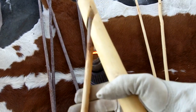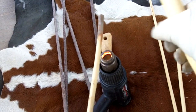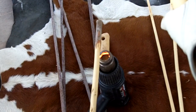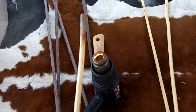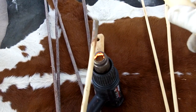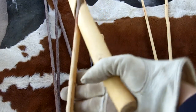I listen to make sure I don't hear any cracking. If you start to hear cracking, you've already bent it too much and you may not want to use that shoot. Little by little, heat only the compression side. I've got it a little bit too hot — it makes the wood harder to compress if it's too hot and it starts to temper. If it starts to get heat hardened, it won't compress as well.